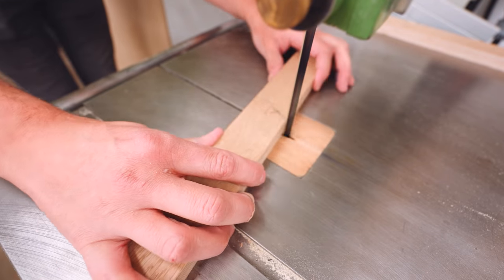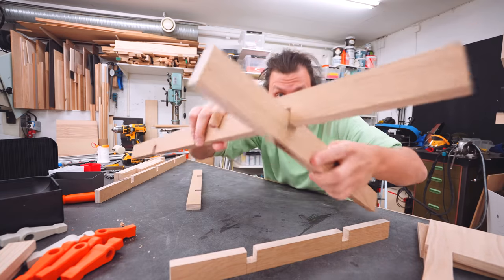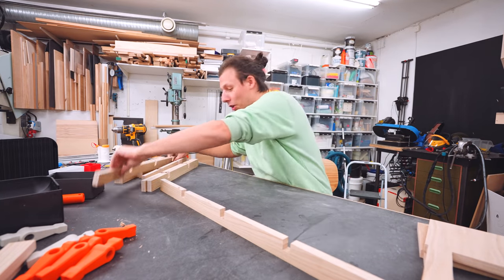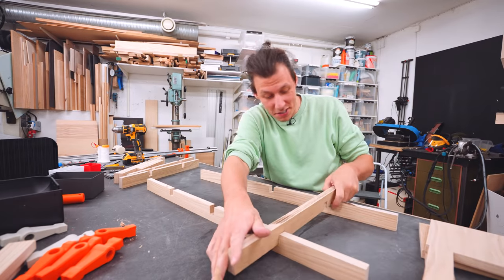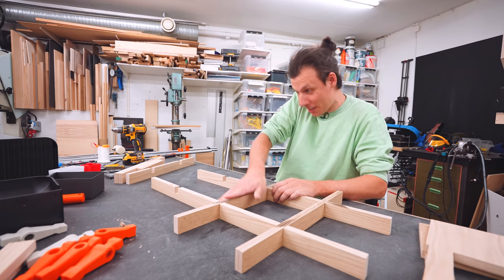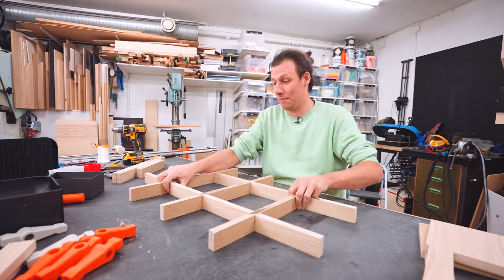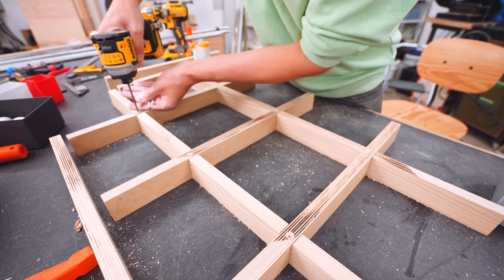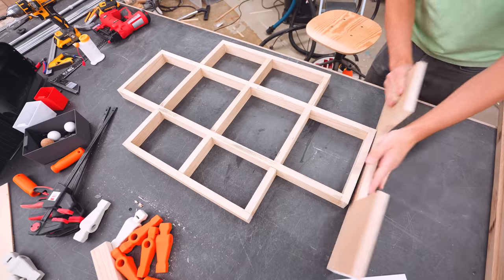I've also cut out a couple of slots in these pieces that will allow them to fit together. A bunch of these will now make the bottom framework that is going to hold everything in place. I've cut these parts on the bandsaw, but you can just as easily cut everything with a jigsaw. These parts go together like so and we can get a general idea of how big this thing is going to be. All we have to do is add some glue, drill some holes, and screw in some screws so that this entire framework is a nice solid base we can attach all the other parts to.